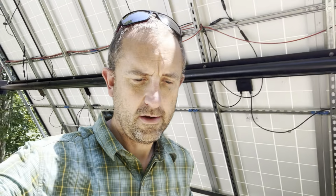It's just that you don't get the power in reality that you often hear talked about from the sun. And of course, if there's any cloud cover at all, that generation capacity drops like an absolute rock. So if it's cloudy out, even with these 10 panels rated at 2,500 watts, I'm lucky if I'm pulling in 200. On a cloudy, overcast, snowy day in the winter, if I'm really lucky, I'm making about 100. So solar is a little bit tough. You can't really believe the numbers that you see.